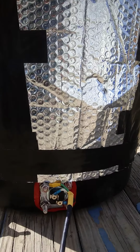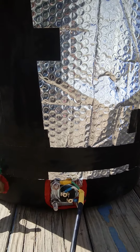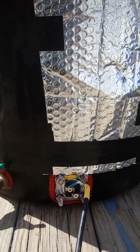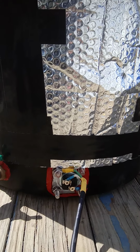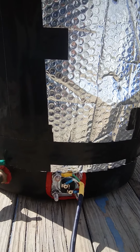And then what you're going to want to do is you're going to want to go get some olive oil or some sort of spray cooking thing. And what you're going to want to do is spray the bracket with this olive oil, canola oil spray. What that does is it coats the bracket, because after you've put down the RTV, you're going to push the bracket into the RTV, creating this recess. And that's the reason for the canola oil, olive oil. That way the RTV doesn't stick to the bracket. The coating of the olive oil will ensure that the RTV does not stick to the bracket. And then you pull the bracket off. Allow 24 to 48 hours for the RTV to cure, and then come back out and put it together.